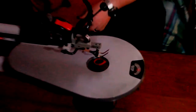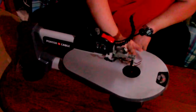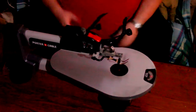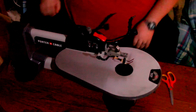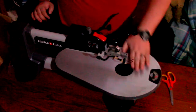I want to see how hard it was to make one of these zero clearance inserts, because if I'm cutting metal it's going to be important. I saw some shortcuts where I can just put some decent tape on here, and I've got some pretty nice Bosch blades for this. This also does pin blades — a blade with a pin on it so it sits in there. But the problem with pin blades is they're very thick and don't work very well for what I need. I need something really thin. Even though I'm cutting metal, I want it thin to get nice clean edges. It's a spiral bit, so I should be able to cut in any direction.